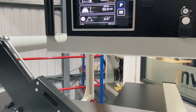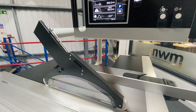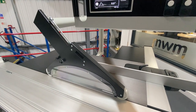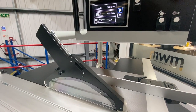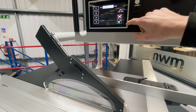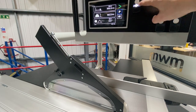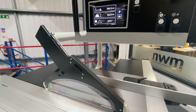You've also got your RPM displayed here, and then press the white button to execute. We don't actually have a blade on the machine at the moment, but you can hear it operating and see the value changing on the screen. Angle works exactly the same — let's do 20 degrees, hit OK, press the white button, and you can even see the blade height change as the angle goes around to 20 degrees.